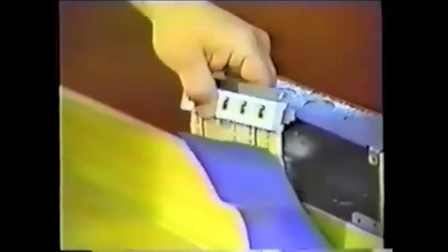Insert the exposed end of the cable into the top slot of the back of the transition block and rotate the transition block 90 degrees. Install the transition block with the cable inserted to the transition block base plate and insert and tighten the 4 assembly screws.